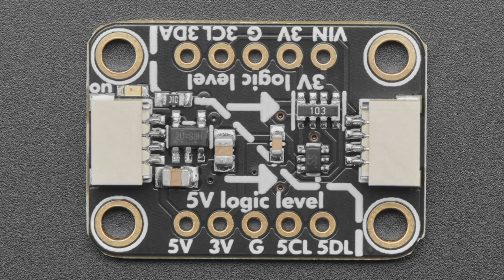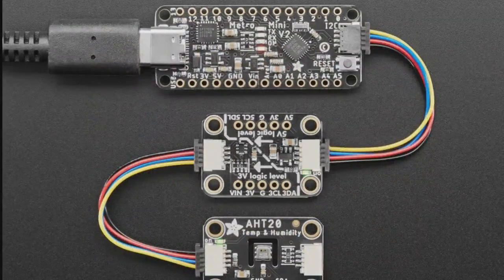You take 5 volts from your Uno, old ST board, PIC BASIC, or whatever 5 volt system you have, and it gives you a clean 3 volt output, with breakout pins for 5 volt and 3 volt logic and power. All Adafruit boards are 3 volt or 5 volt compatible, but other manufacturers — like the SparkFun Qwiic originator — may not make them 5 volt compatible. This ensures people still using Unos can safely use the plug-and-play system without damaging their sensor devices.